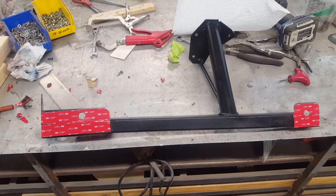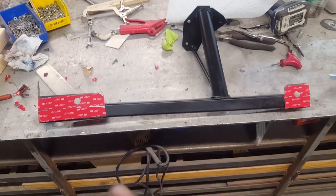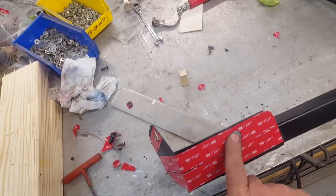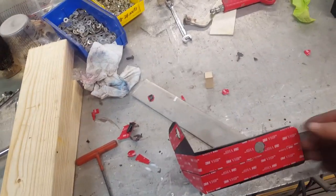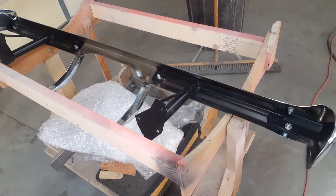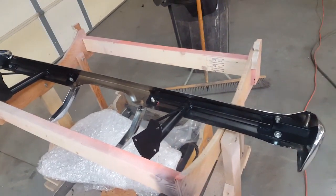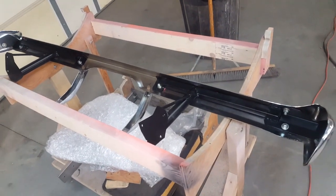Getting ready to put the bumper mounts back into the bumper — primed and painted them. I've got some old double-stick tape whose backing won't peel off anymore, which is perfect — it's about a 16th thick with a nice slick surface. I'm just using that as a pad between the chrome bumper and the bracket so the paint doesn't rub off from vibration and cause rust stains, and hopefully it keeps it nice and quiet too. That's what the bumper looks like with the brackets painted up and reinstalled — those aren't the proper bumper bolts just yet, but they're coming.